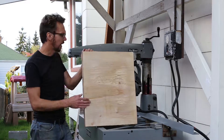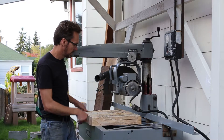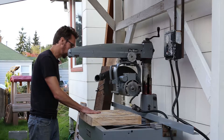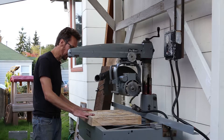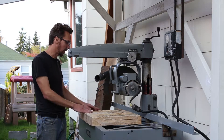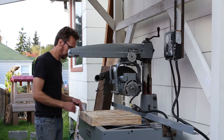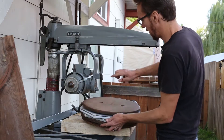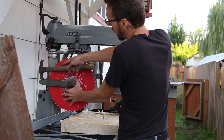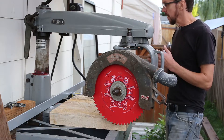I've got a plan for the other surface, and now that this side is fairly smooth I can put it down — it has a solid surface to work off of. I can actually use the saw to cut some marks in here and get this surface level to the saw. That will actually be the best way to level it, because the saw blade will be cutting it directly. I got the board in position, screwed down — here goes nothing.